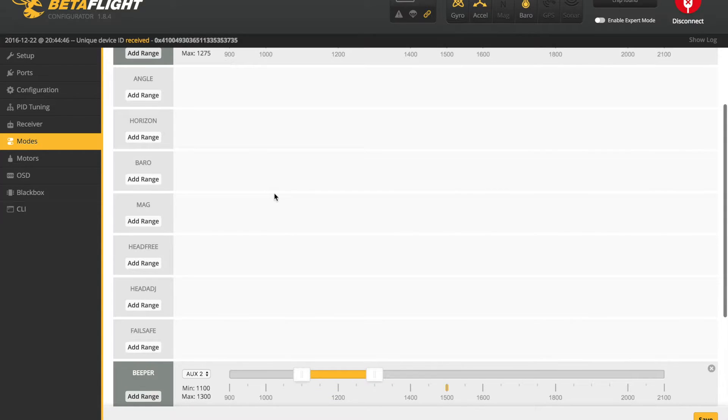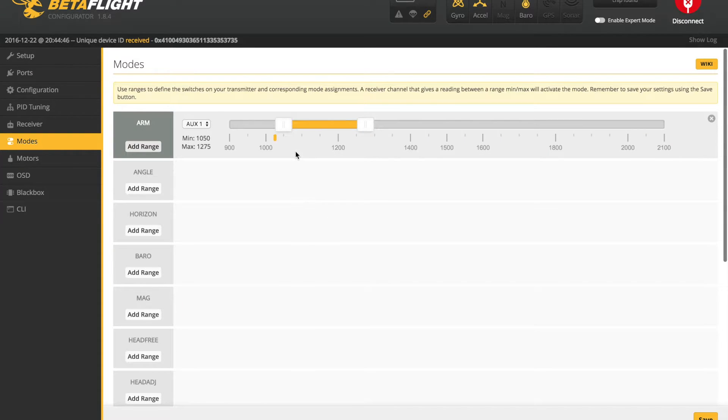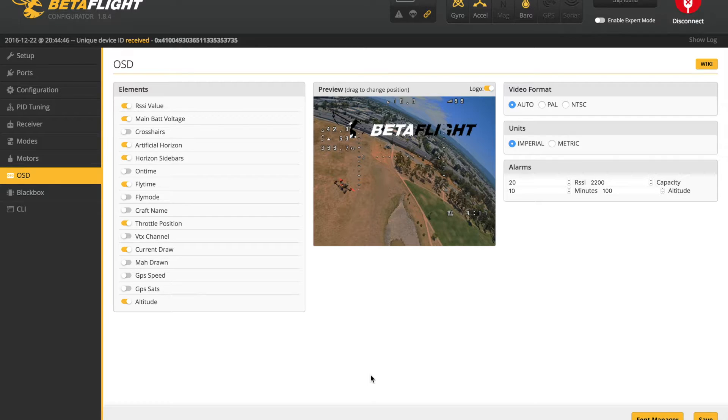As far as modes go, the only thing I'm going to do is turn on the beeper and turn on the arm switch. The OSD works just the same as the last Omnibus flight controller. If you've got your quad plugged in and transmitting, you can pretty much see in real time how the OSD is going to look, and you can go in and flip these toggles and see it update. One of the problems I noticed during the video is that the OSD would turn off. I think that was because the CPU was getting overloaded and it turns the OSD off as a fail-safe. If somebody knows why that's happening and I'm incorrect on that, please throw it in the comments below.